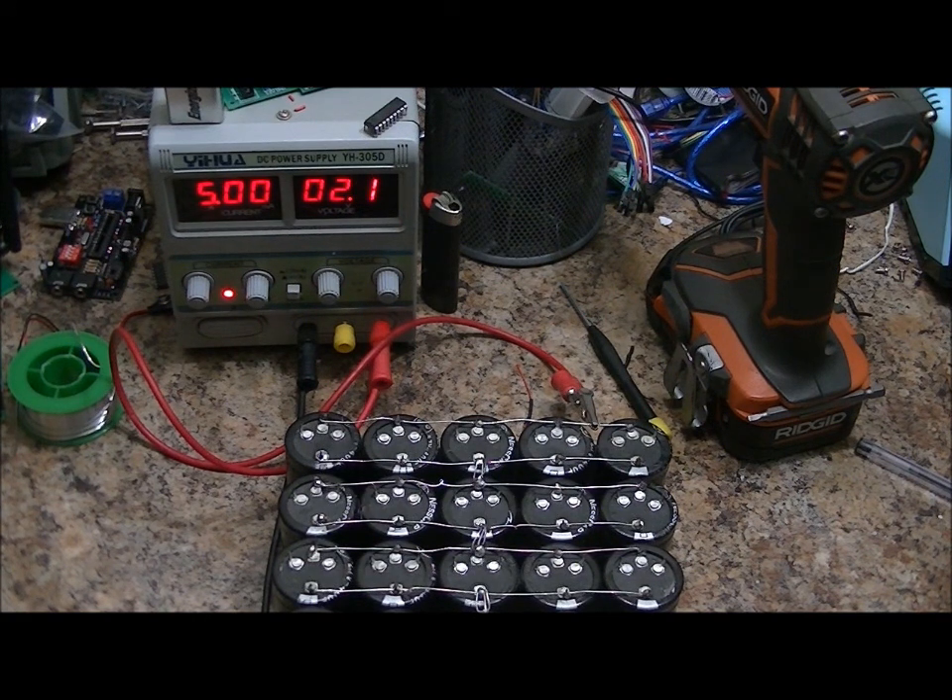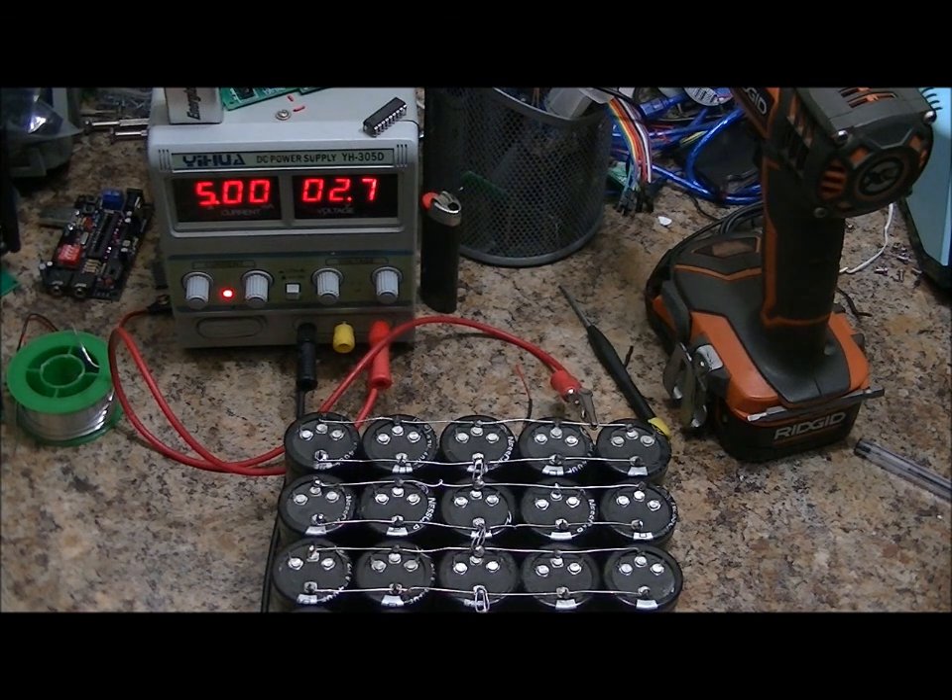The thing about these capacitors is they have such a large tolerance — capacitors like this typically have a tolerance of about 20%. So charging it to 12 volts, even though it's a 13.5 volt capacitor bank, is probably safe. I don't want to overcharge them. Now these capacitors are all old, overused, and potentially damaged. So I expect that if I charge it to 12 volts and leave it overnight, it'll probably lose anywhere from 25 to 50% of the stored power — because these capacitors are used and likely abused. A new supercapacitor that's treated well will likely only lose about 10% of its charge over a period of 24 hours.